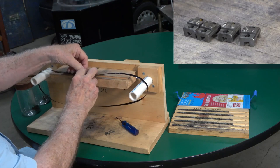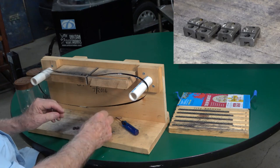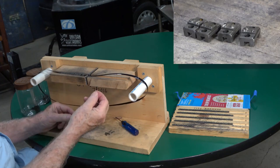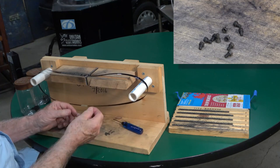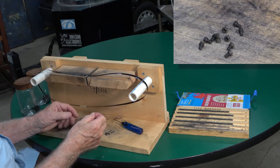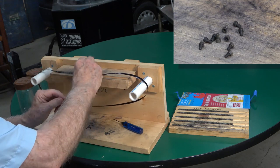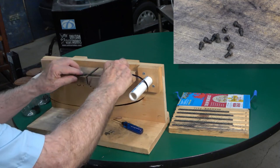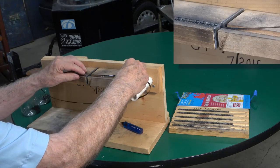And again, tweezers work nice. And then once you have that, you take your tweezers. And by the way, the type, the back bars, the slugs, the screws, and the end of the tightening wrench all have to be demagnetized. Otherwise, you just can't handle these small pieces. They're sticking and you have no control. So take your tweezers, put it into each hole, two screws each hole, and then you pull the band this way so it butts right up against the previous slug you had on.